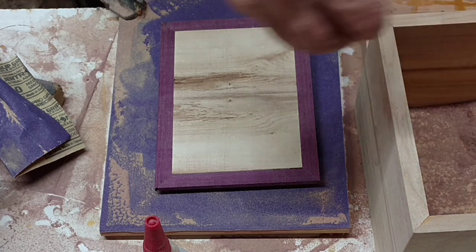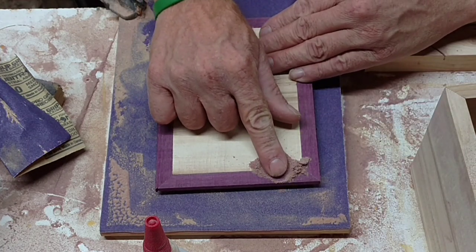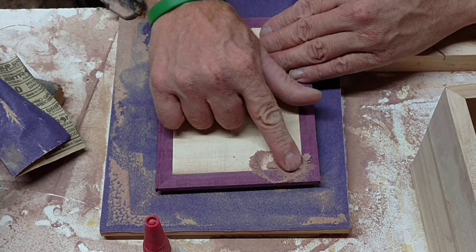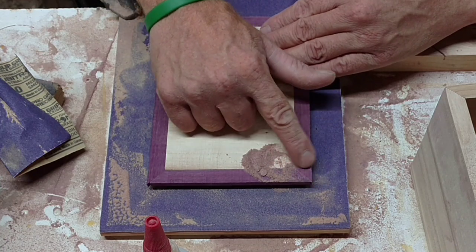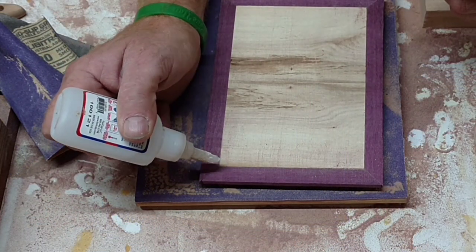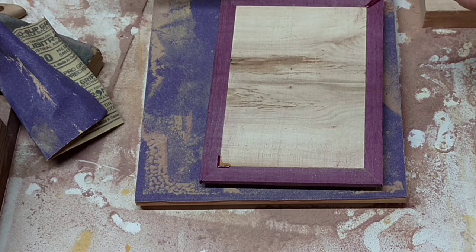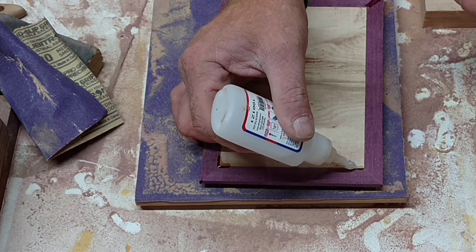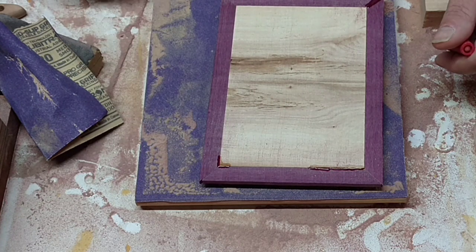What I'm doing here is I'm actually working the native sawdust into the glue joint dry, and I'm pushing that dust inside the glue joint with my thumb and fingers. Then I'll come back and put a little bit of CA glue on those areas and let it soak in. I usually use a medium consistency CA — 2P10 has that. In some applications I go for the thin because it'll soak into the glue joint a little bit more. I will not use an activator on this because the activator will create a chemical reaction and actually create bubbles in your CA.